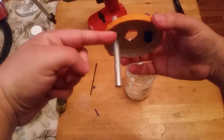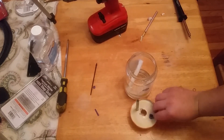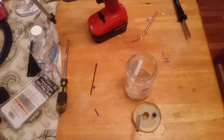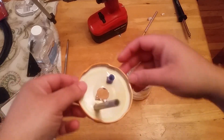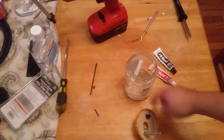I've seen other builds where they cut the tube short, but I think having the air go down from here will create more circulation and go up, hopefully giving us more smoke that way. Otherwise I can just chop it off. To seal it off, we'll be using JB Weld. I have different styles but this is the only one I can find — it's meant for steel, but oh well. When doing the JB Weld and the cuts, we need to be as far as possible from the seal in here, because if we hit that we'll ruin the airtight seal.